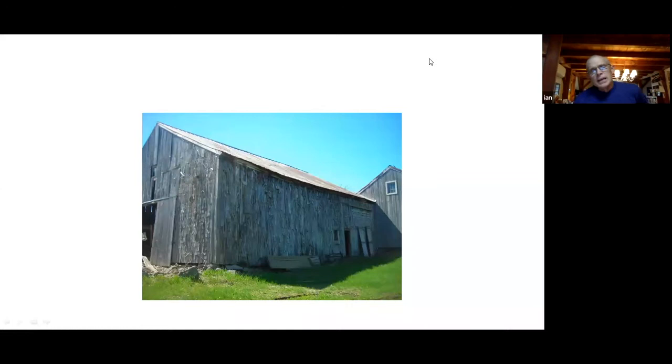The problems that Yankee barns have are really specific, partly with the foundation — whether they're ground level or whether they have a full basement. The important thing to remember about a ground level Yankee barn is that when it comes to the foundation — and this is true of all timber frames — the most important part is where the load bearing points are, and those are under where the posts are.